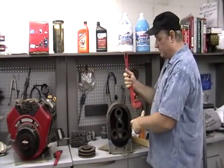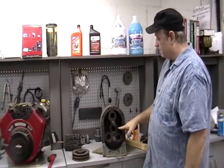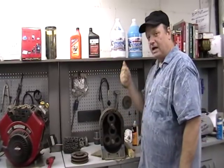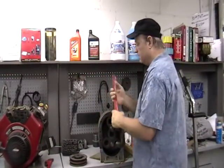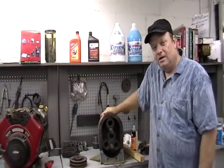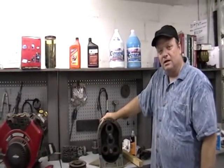I know it's hard to believe, but you can feel it flexing if you put too much torque on it. Ever since I've come up with a direct hit on the rotor, every time it pops it loose. So if you can get in there, direct hit it — once you move a little bit, then you can take the pipe wrench and get it loose. And that's all there is to it. So Brandon, I made your own personal video just for you on the blower, getting it unstuck. See ya!